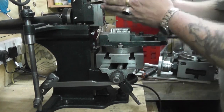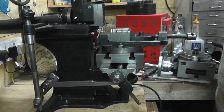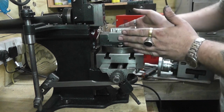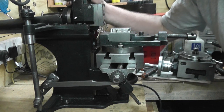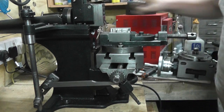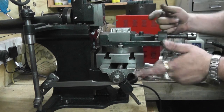So you can do single cuts, move down, say you're doing a deep groove, or a dovetail. In fact, if you're doing a dovetail, you don't want the bed moving. You want to adjust the head manually. So you just pop that out, and then each time you do the stroke, you're going in the same plane; the bed isn't actually moving itself.